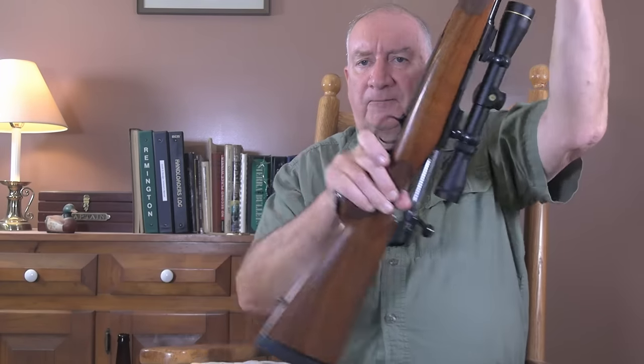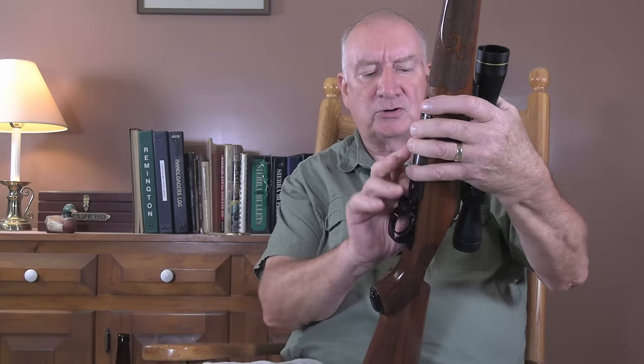You can tell if you've got sponginess by the way the screws go in. When you wind those screws in and feel the first contact — where the screw head hits the trigger guard steel — you shouldn't turn more than 90 degrees after that. You shouldn't feel the wood progressively getting closer to the metal as you tighten it down; that's a very bad situation. Also, stay away from oiling the rifle because oiling will cause all kinds of headaches with accuracy as the wood gets punky.